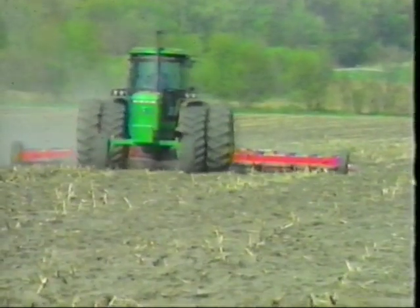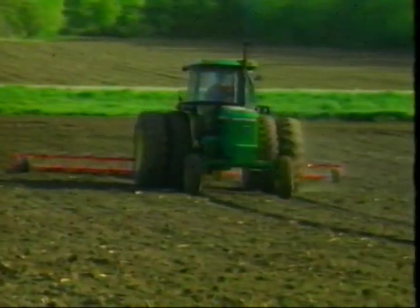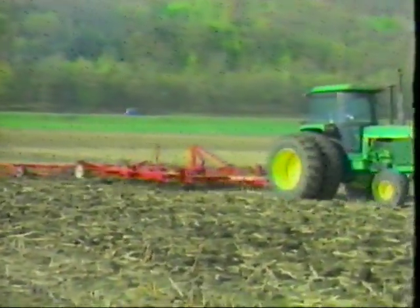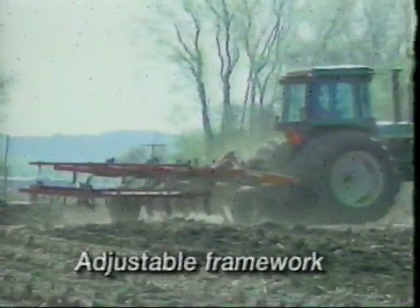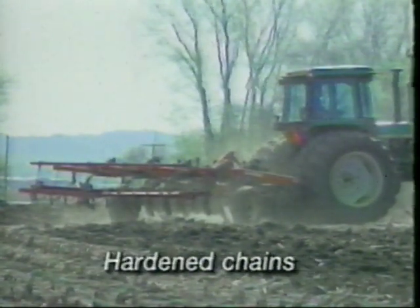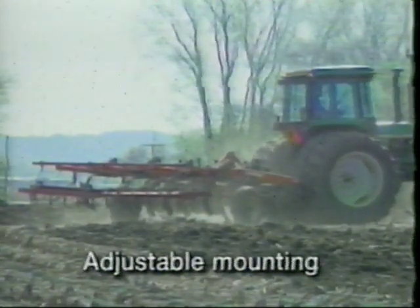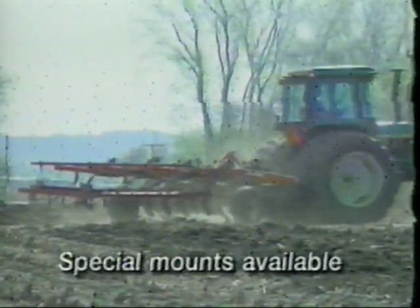The result of over 50 years of experience designing and manufacturing, McFarlane Harrows are America's finest harrows. Combining McFarlane's long-standing tradition of rugged dependability with new features designed to provide maximum coverage and easy handling, McFarlane Harrows are built to last, built to work. The CTM features a strong, fully adjustable framework, adjustable sections for aggressive harrowing or superior trash handling, sections suspended with hardened chain, and replaceable three-quarter by 11-inch high-carbon teeth on 11-inch centers. Adjustable mounting fits 3-inch, 4-inch, and 6-inch rear toolbars, allowing the CTM to fit most chisel plows. Special mounts are available on request.